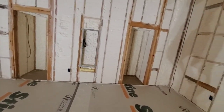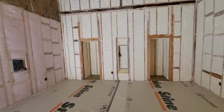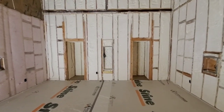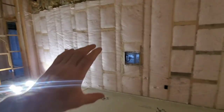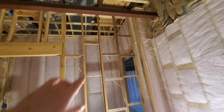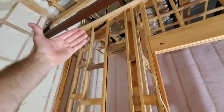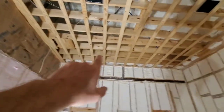If you've seen any of my plans you know we do not stick the mains flush into the wall — we're going to put them in right. This is actually a Triad demo room, so anyone that comes to listen, by reservation, is going to hear one of if not the best sounding rooms they've ever heard. It's going to be a fantastic system. We've got the Triad Gold LCR, and everything else in this room is going to be the Silver Series — the Silver sat in-walls for the wides, and the six-inch version for the Atmos top and rear. The rears are going to be Silver Sats, actually in-room speakers on a bracket, pulled forward and well clear of the horizontal dispersion.